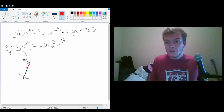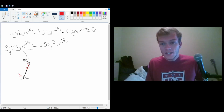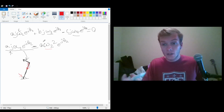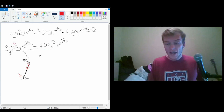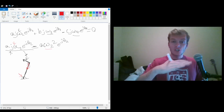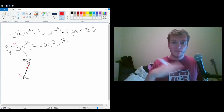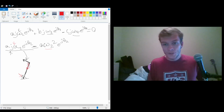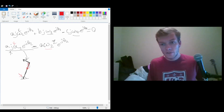And what's interesting about the vector notation is this right away tells us that this acceleration is actually due to the angular velocity and not due to the angular acceleration. So we have another acceleration, which is the change in the angular speed. And this makes sense. If we're putting a force on it this way, it's going to want to whip faster than it already is. And then we have the second term, which is pulling it in towards the middle, which means that it stays on a circular path. So this is true for all of the points.